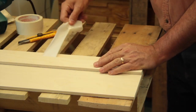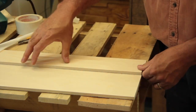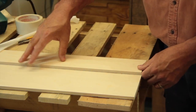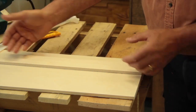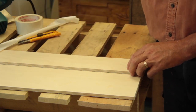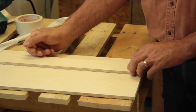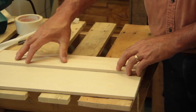Once you're at the right spot, you can now peel off the protective layer. So this method using a double face adhesive is pretty forgiving. Having just a short section glued first, you can easily proceed with adjustments without damaging the adhesive while trying to lift and reposition your piece of wood.